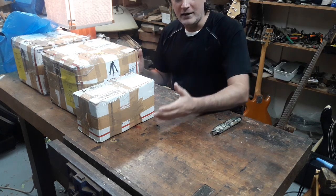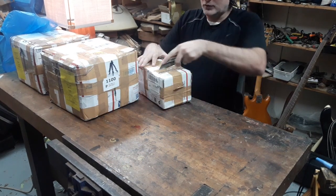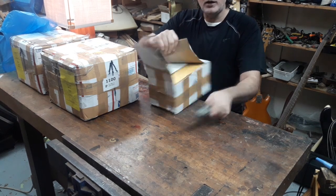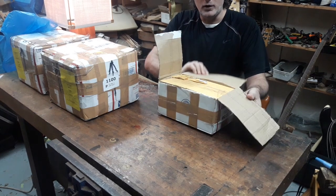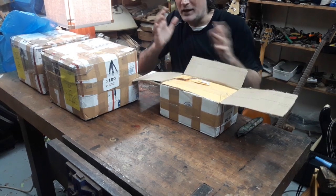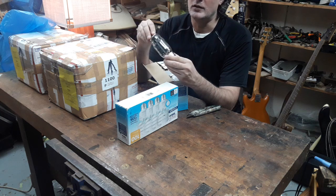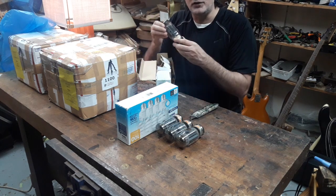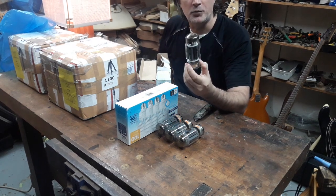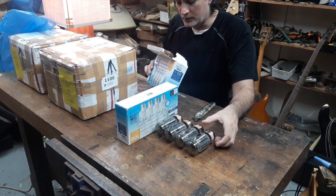Okay, so I've been looking at Dynacos on eBay for most of the last year. So I pounced on these about a week ago because I've been looking at Mark 3s and stereo centers. I eventually decided I wanted to get a pair of Mark 3s. I was mostly looking at unrestored amps, like virgin amps that people just got from storage. But this set came up for sale and they had modifications, new capacitors and very good tubes. These are Tongsol KT120s which have come with them, and these are kind of the premium high power tube these days, certainly good for hi-fi, and from what I've read they're very good in Dynacos.